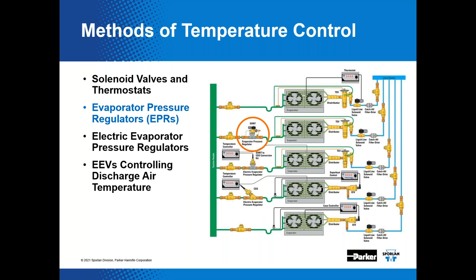The temperature correlation is based upon the heat transfer characteristics of the evaporator. Sporlan EPRs are designed to accurately maintain evaporator pressure at a consistent temperature under varying evaporator load conditions. When the evaporator load increases, the valve will open on a rise of inlet pressure above the set point of the EPR. The nomenclature of the valve implies how it actually functions.